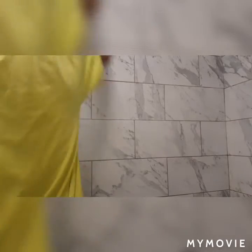Well, let's just say you do. Okay, so I accidentally left my mess on here till the next day. It'll still come off. And if it doesn't want to come off for you, vinegar. Get some distilled vinegar or white vinegar, and that'll take your grout off the tile. If you forget about it and you come back and you go, oh, I forgot to clean my tile, a little bit of vinegar will pop it right off.